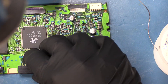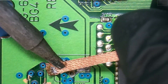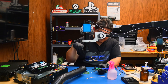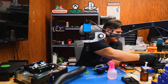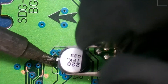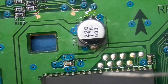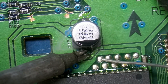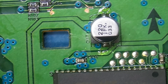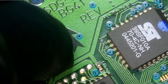Let's go ahead and install our replacements. Clean up this solder pad first. In one of our previous videos, a YouTuber had mentioned that you want to use this method for soldering on the capacitor. Our good buddy Nick at Nick's Electronics also uses this method when installing capacitors. And now you just add solder to the other side. This is a very delicate PCB, so I don't recommend pushing too hard when you do this just to make sure it's soldered on.